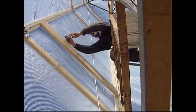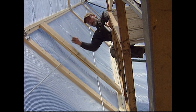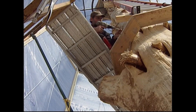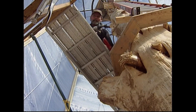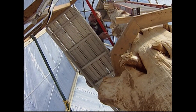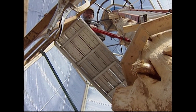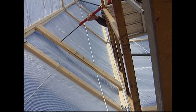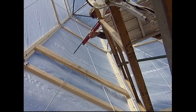We bring this mark down here — this is the vertical line that matches for our centerline design of the stair tread. Then we drill a starter hole, half-inch diameter and only about three-quarters of an inch deep. Then we can level across with a little half-inch pin taped to the level to transfer the mark across. I've got a half-inch shaft that sets on top of the level, and I bring it out to the line on the outside, get it precisely level, and mark — there's a little pinhole there.